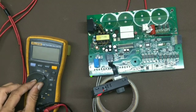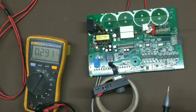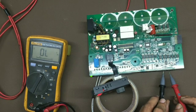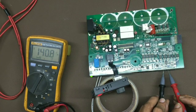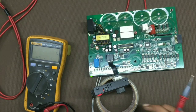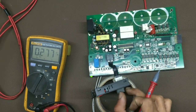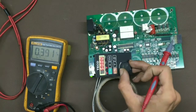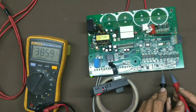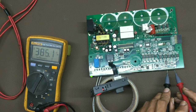Now let's check the output voltage. We turn the meter to AC — and this is U, V, W. 140 volts, 140, 140, 140 — balanced. Now we will increase the speed to full maximum; it is now 50 Hz. Now 380, 380, 380 volts.